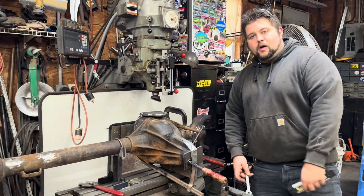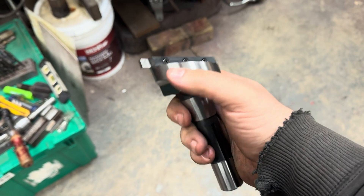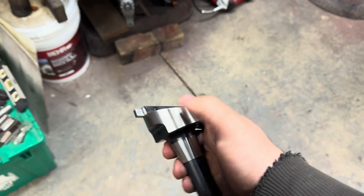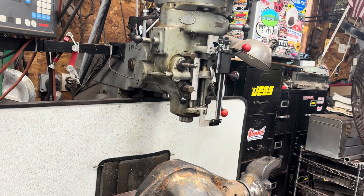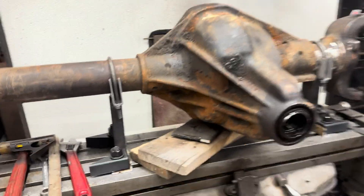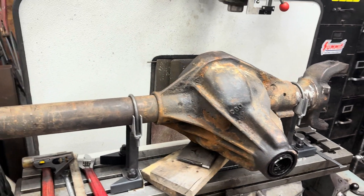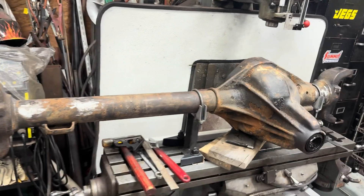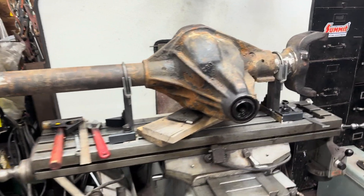So follow along and we'll get to it. I went out and grabbed the cheapest fly cutter that would be here in a day from Amazon. We're going to throw that up in the bridgeport and see how this goes. I also shimmed a couple pieces of wood and a plate underneath to keep a little bit of vibration out, and we're looking good. Hopefully this is one of the last times you see this axle fully cast.